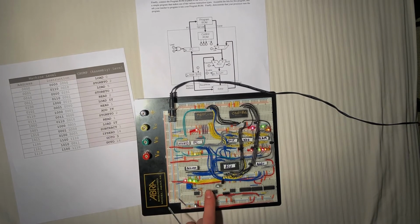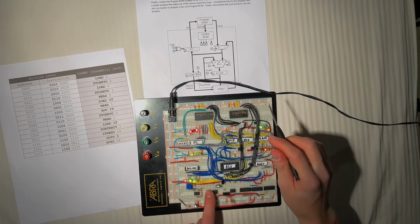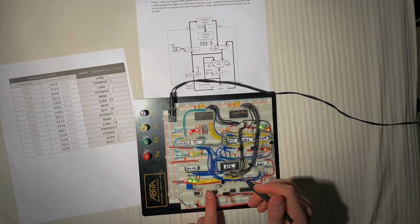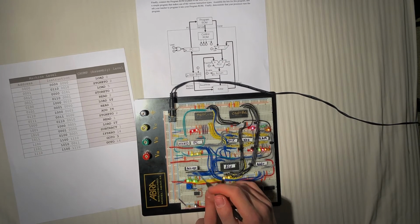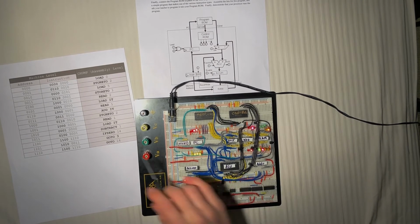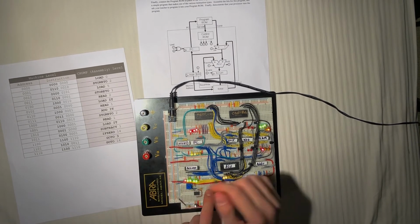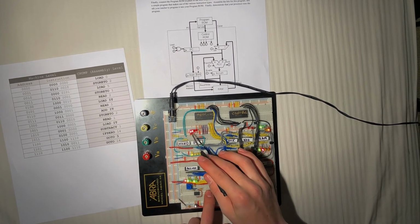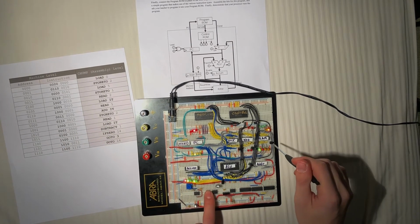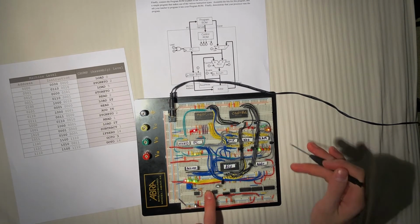After the adder, we're going to store that into address 2 again. So now we're going to read a 1. So we're going to read what's in address 1. It's a 5. We're going to load it. We're going to subtract 1. It's now a 4. We're going to check if it's 0. If it's not 0, we're going to keep going. And the next command is a go to 3 command. So we're going to go to line 3, shown by the program counter outputs. So in 3, we're going to store that 4 into address 1. There's a 1, and that's my 4, least significant to most significant.